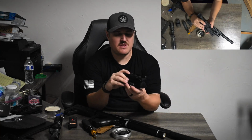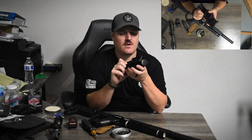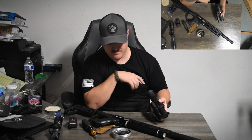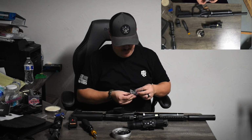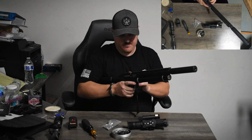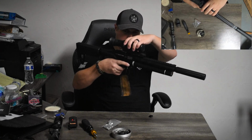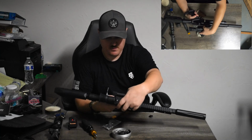To note, on the bottom of this, it takes about 35 inch pounds to square these three up. And we're going to have three more here, but those are going to be at 30 inch pounds. One thing we are going to need to be aware of for this is the magazine. There it is. Will we clear it? Fairly certain that we will.